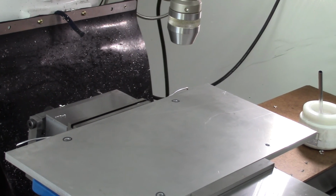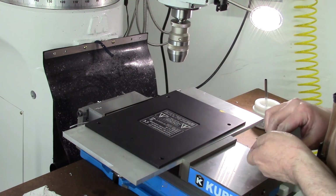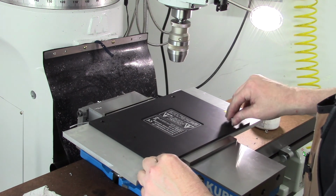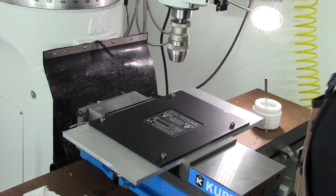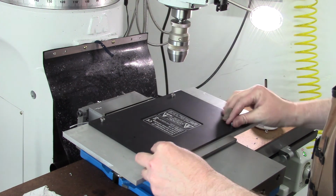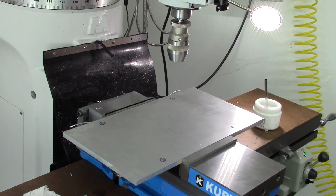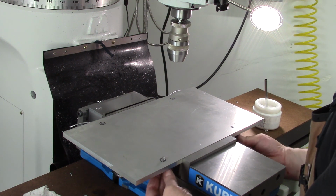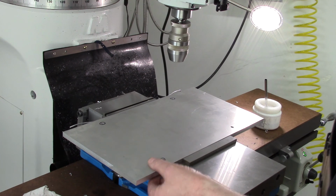Zoom it out a little bit. So just take our bottom plate that we used for pattern, and assuming that I actually punched all these properly, we should just drop in and we're good to go. And like I said, we've got lots of clearance, so there's no problem. We can bolt this to the other thing and drill those. The cool part is I can actually change them without taking it out of the vise. Have the same setup for both, so they'll be exactly the same.